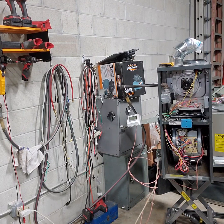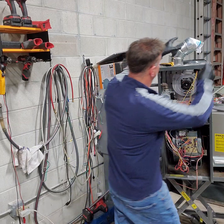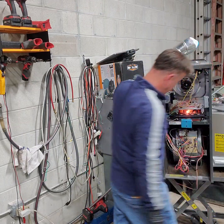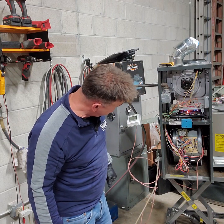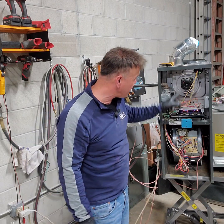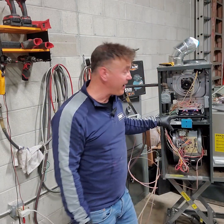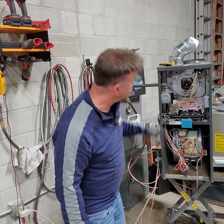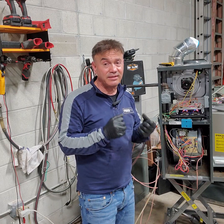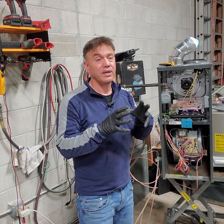So we're gonna see the pressure switch is gonna read really very low pressure, and it's gonna open again. Let me see. Wow, it's even running. See, the pressure switch starts feeling the pressure is not, the combustion is not going outside, so it's gonna shut the gas valve. You're gonna see. When you feel that burners are coming back and forth, you know there's something stuck in the chimney, or the pressure switch is barely reading a healthy negative pressure.